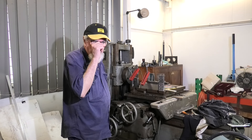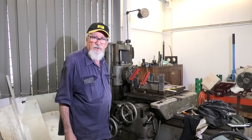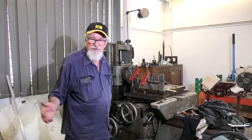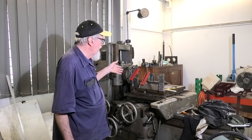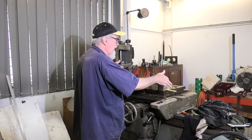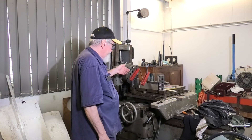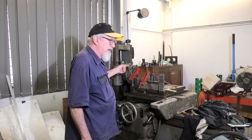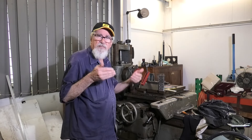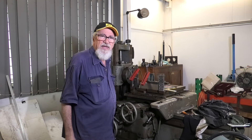I bought it originally because I built my first boiler and used the radial arm drill to drill the tube plate, and then thought about how much longer a boiler I could do. Anything bigger than a Sweet William boiler is not really suitable for the radial arm. Whereas with a small HBM like this, if you crank the table along, you can put a one and a half to two metre long boiler up on the table. And one thing I found very handy is you can drill a hole and then face that hole, so all the holes on the back head will be in the same plane — fittings going in the same direction and not splaying out in all directions.